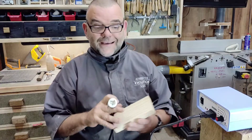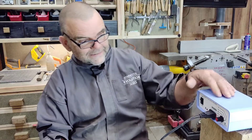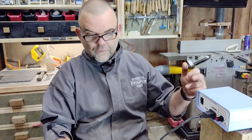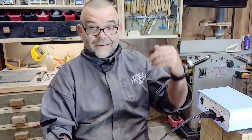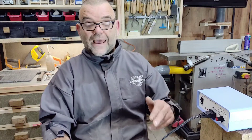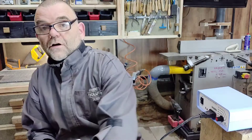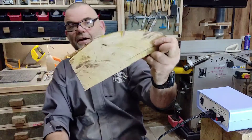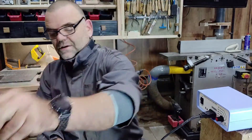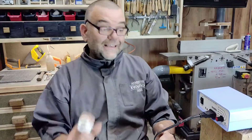So it's very, very effective. This unit is only 40 watts of power — that's all it needs. But it goes from 450 degrees all the way up to 750 degrees. I've been having a bit of fun with it recently. What I'm going to do is demonstrate on a couple of heat settings, just to give you an idea how effective it is on different woods. I've got a bit of old pine, a bit of oak, and this offcut — actually part of a point I made on a post — chestnut. They're all seasoned, so they're relatively dry.